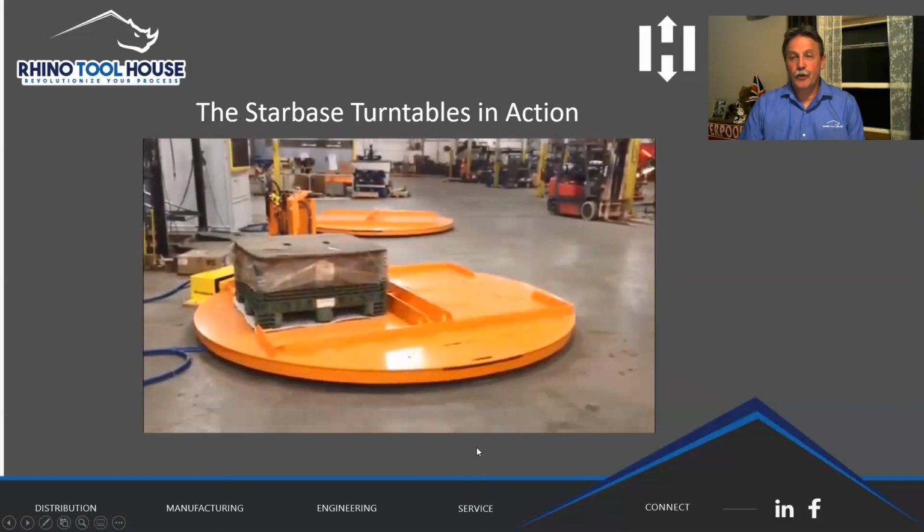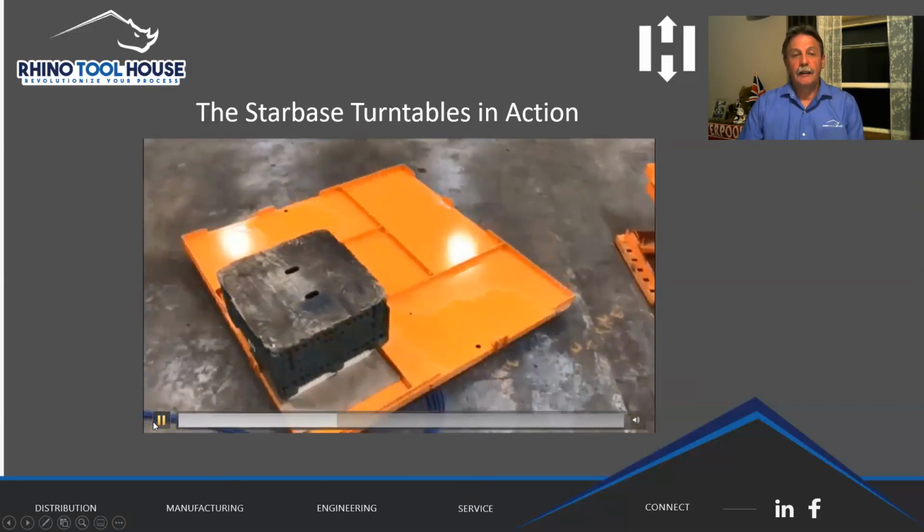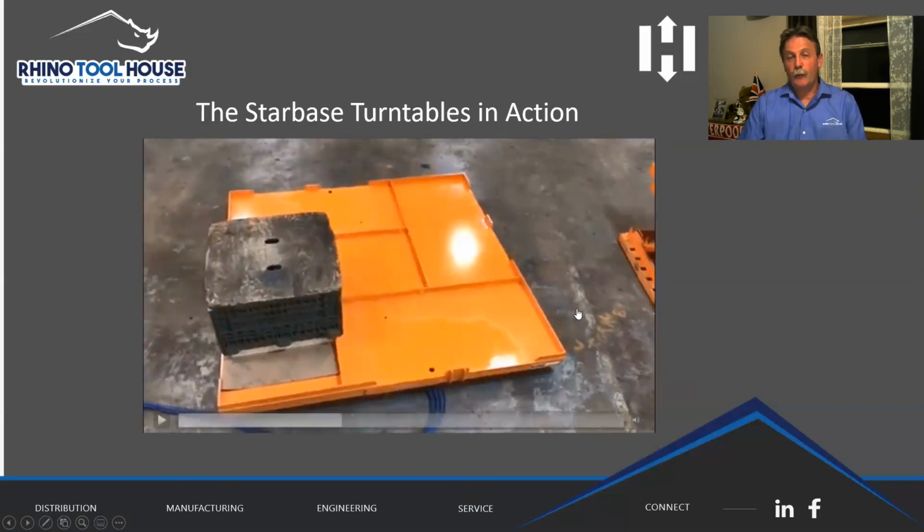As you can see, this is a round turntable, so it would be encased in a platform. So this is a 2-position turntable. So here we see a 4-position turntable, and now we actually call this a side by end, which has got 4 racks go on here, and the operator will be working out of this one, and then the empty one will go to here, and it will be changed, and the fork truck driver can either change 2 at a time or 1 at a time. And the reason for a 4-position turntable as against a 2-position turntable is the fork truck driver only comes around half as often, which makes his time more efficient.